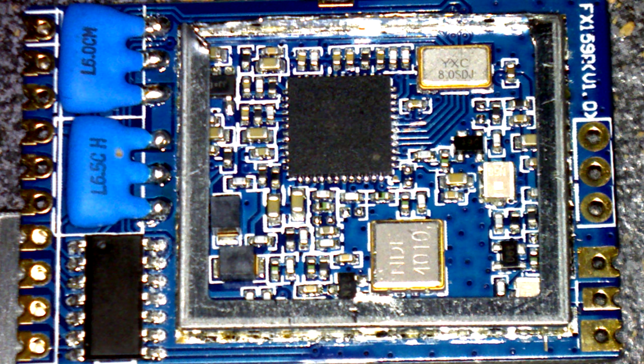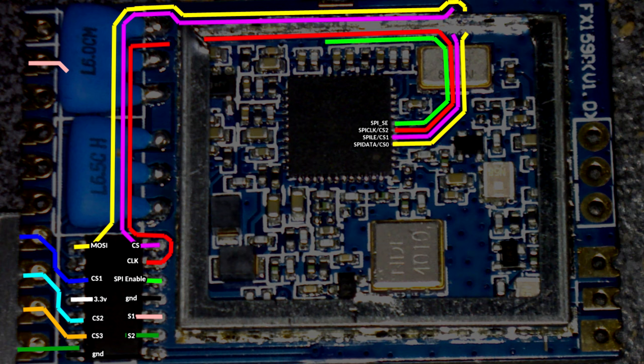and the FX159. What it appears that they've done is, in order to get 40 channels out of the receiver, they've put a microcontroller in front, in between the dip switch inputs, and that talks SPI to the RF chip to change the channels. So what we need to do is to bypass that, because we can't pass SPI through